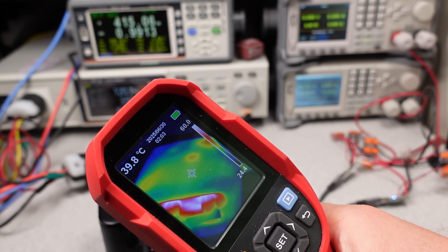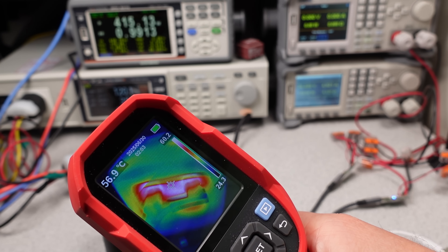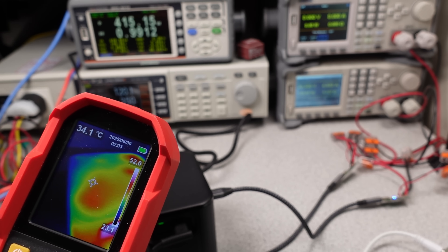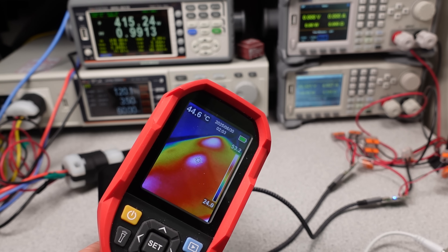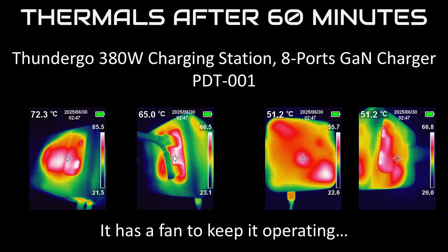In the thermal testing, the device stayed on. It does have a fan in it — it makes noise, so it's not something you're going to want in your bedroom. I actually couldn't hear the fan over all the test gear whirring away, so it's not insanely loud, but you will hear it. It does still get hot. Even the unused USB ports get very hot. With the fan, it was moving a tiny amount of air — they didn't optimize the air openings to actually provide good cooling. Not a surprise for an inexpensive device. Still, it does work at its advertised power. The isolation will be coming a bit later.